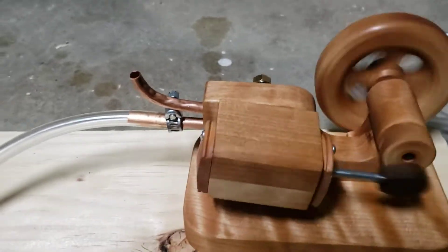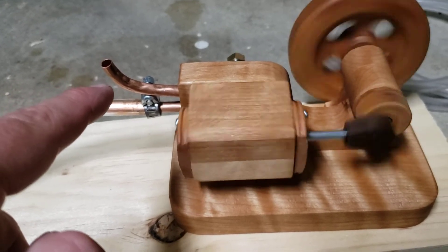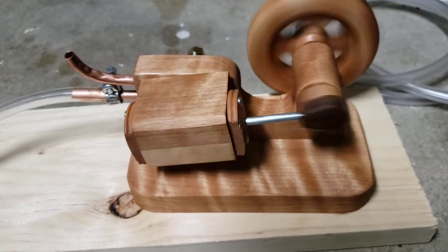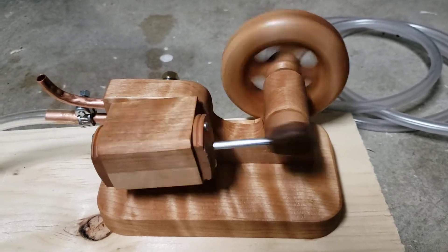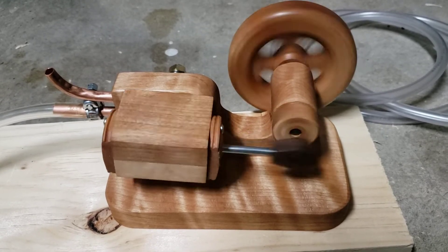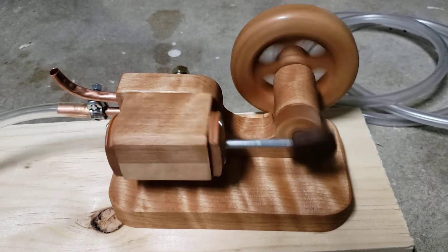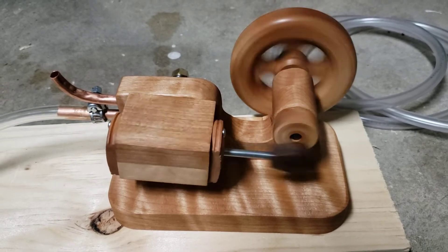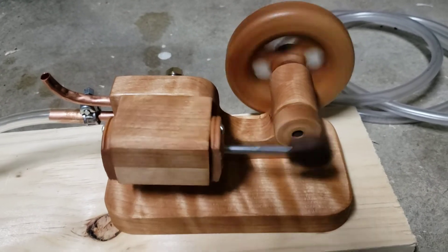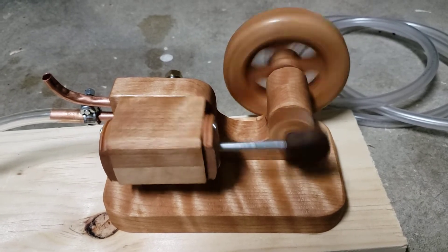Theoretically I could change directions by hooking the hose up to the other port. That other port isn't really designed for that, but if I wanted to I could pull it out and put a straight pipe in and switch the ports at will. Practically, the mill engine didn't need to reverse direction — it just needed to run one way. On a marine engine, where reversible rotation would be important, it'd have a little valve switch right here. You'd be able to turn the knob and vary not only the steam pressure but also the direction of steam from one port to the other.